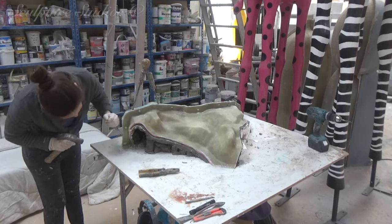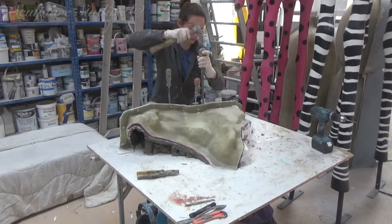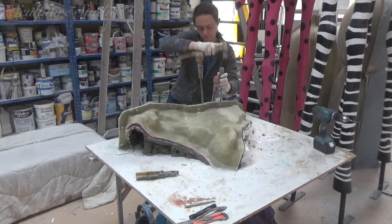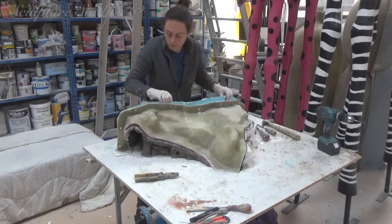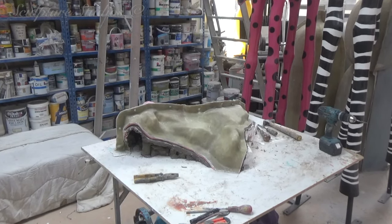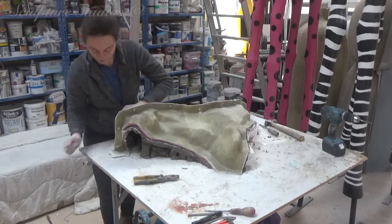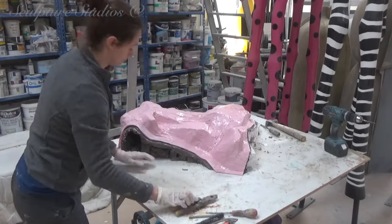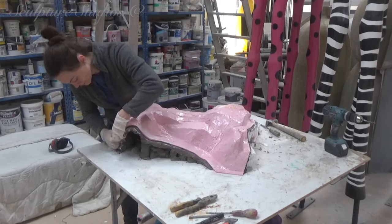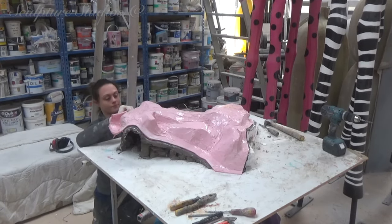Even though we're creating a mould from one piece of rubber, built up in progressively thicker layers, the fibreglass jacket of the mould is going to split into a couple of sections. This is for ease of getting this apart. The fibreglass jacket has bolt points along the flanges so it can be joined back together, and this jacket ensures that the rubber retains the correct shape when it's laid back inside.